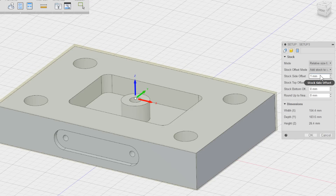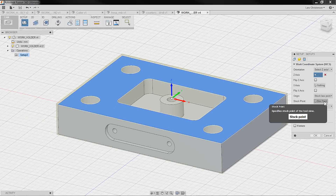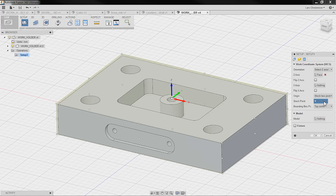What relative size box does is analyze the part and create a boundary box around it, and then you can add some extra material. We normally don't order stock at the exact size — we leave a little bit of material so we can machine it. I'll leave this at one millimeter. By setting this on the second tab, when we go back to the first tab we can select the right place. For this part — thinking that this is a raw block of steel — I'm going to select this upper corner. The reason I'm selecting this upper corner and not, say, this corner instead, is that this corner is what I'm picturing to be against my solid jaw on my vice. I'm going to hold this part in a vice.